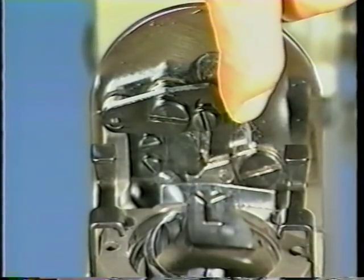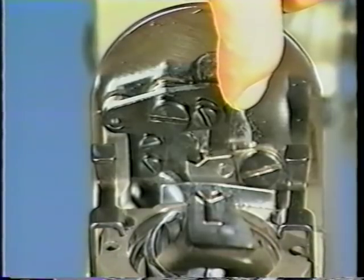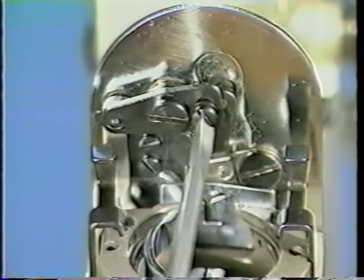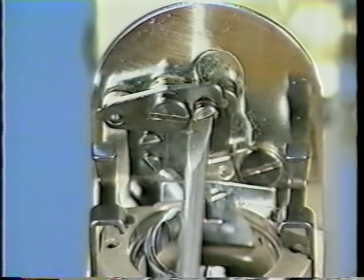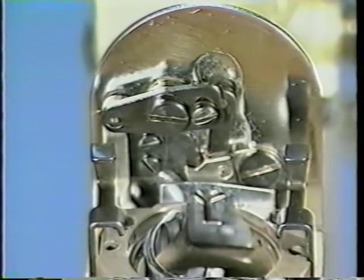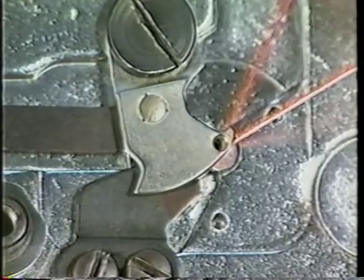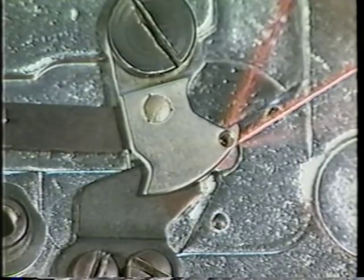If the moving knife is too close to the counter knife, the sewing machine may perform thread trimming at the moment of stop motion, or the thread spreader may fail to actuate with consistency, resulting in thread trimming failure. If the moving knife is too far from the counter knife, the moving knife will fail to engage with the counter knife, resulting in thread trimming failure, or the needle will interfere with the moving knife, resulting in needle breakage.